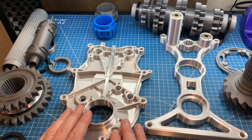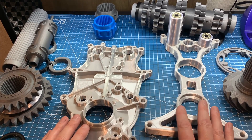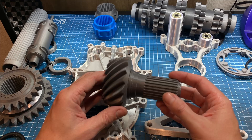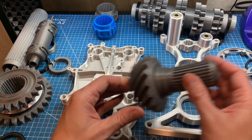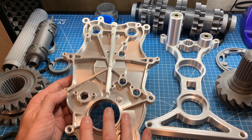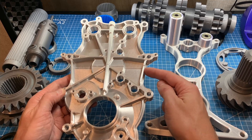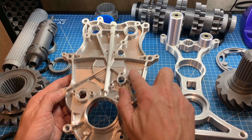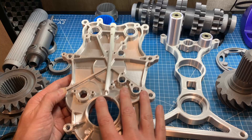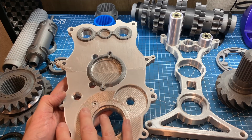Now that I have the shafts and a few gears, I need a frame to hold them in place. So I printed the input cover and the rear stand with some additional spacers. For this particular gearbox, I also had to print out the output gear shaft, which acts as a bearing retainer for the main shaft. The input cover for this gearbox is definitely more complicated than the input cover from my previous gearbox, and it's actually larger than my 3D printer, so I had to print it in two pieces and glue them together. I'm not entirely happy with the seam here, and I'm going to redesign it and reprint it to have the seam in a different location. I've also had to print some of the details on the back of the cover as separate pieces just to make the overall cover much easier to 3D print.